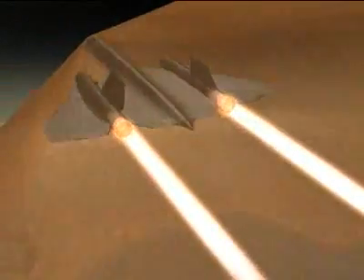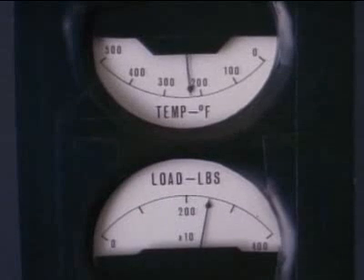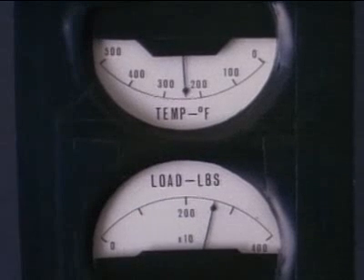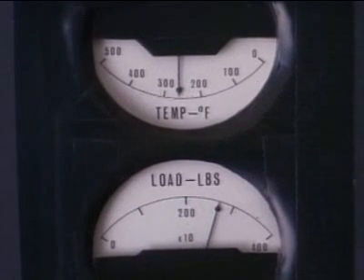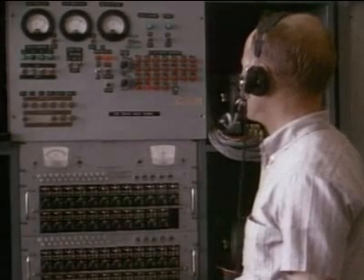In extended flight, she would bake for hours at temperatures that would melt a traditional aluminum skin. To combat the heat, the plane's designers would use a rare and unproved alloy — titanium. Titanium could endure the heat, but was it strong enough to survive the stress of supersonic flight? To find out, they baked and stressed the plane in a giant oven at extreme temperatures. The test was reassuring, but how would titanium perform under the actual stress of flight?